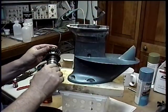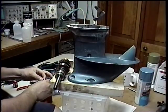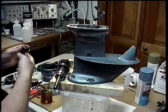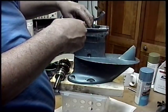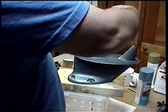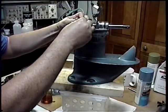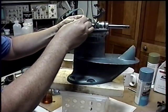This thing is all pretty much assembled now. The pinion gear has to go in — we'll take the pinion and put it in the oil. Some pinion gears have a thrust washer, but this one doesn't. It's going to drop right down in the hole, and then this whole assembly is going to go in like this — drops right in. We've got to line up this back piece like I had done, but it's not lining up. Why is that not lining up?